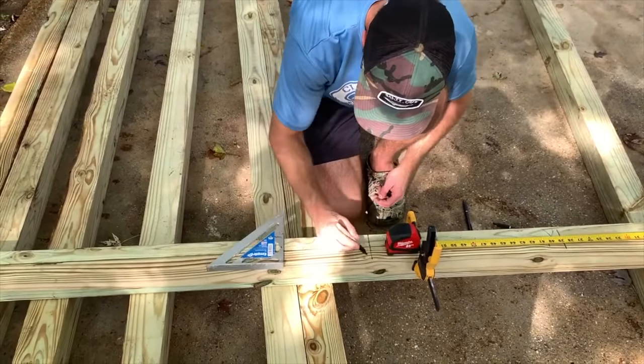Just like before, I'm taking the starter trim at the bottom and I'm securing it to each stud along the bottom plate using the provided screws. After attaching the starter trim, I took my vertical pieces of J trim and I tucked it behind the starter trim just like we did before. This process is pretty redundant, but I wanted to show a couple different angles for clarity.